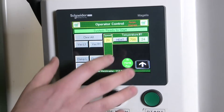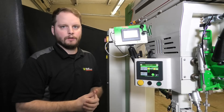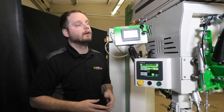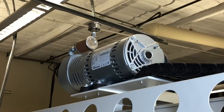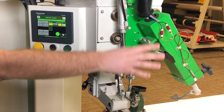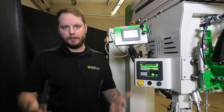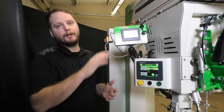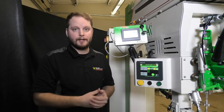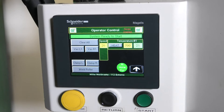Something I say to all of my customers: once you turn off your heat function on your HMI screen, your air compressor will have a three-minute cool-down period, which will send cool air through the housing to cool your heating elements down. I call it the silent shutdown. Once your air compressor goes completely silent, you are then actually able to turn your machine off for the day, go to break, whatever you need to do.